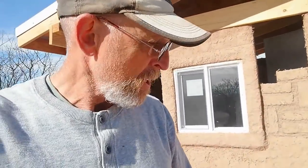Okay, so it's the next day. The mortar is really dry, and you can see that there is a little bit of color difference, but not as much as we had hoped. So what I did yesterday was I made up a batch of small batch mortar using some printer ink that I have here, and made a little burger. This is just the same mortar mix with the ink added, and I wanted to do a color comparison. What's funny is I just kind of guessed at the amount, and the color that I got pretty much matches exactly what the charcoal looks like. So what I'm going to do today is I'm just going to go for it. I've got to get this done. I'm going to make another mix of mortar, and I'm going to probably triple or quadruple the amount of ink I used. I'm really going to make it dark and see how it works out. I'll show you the process.